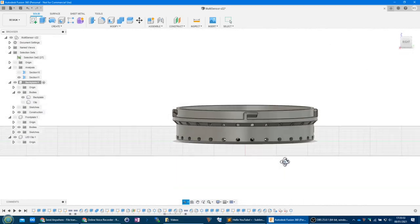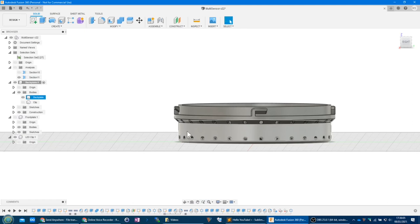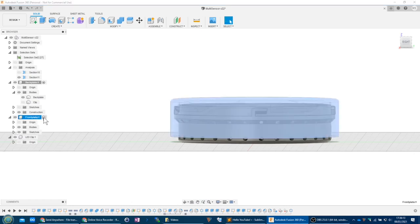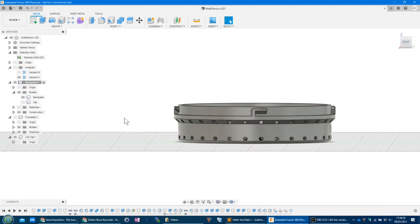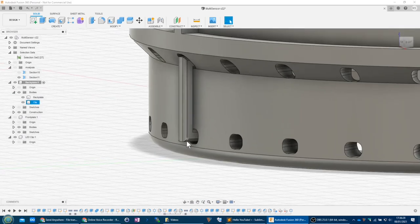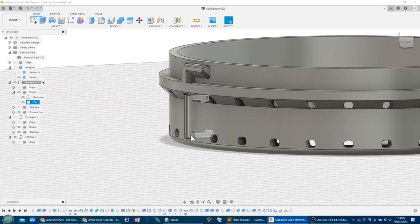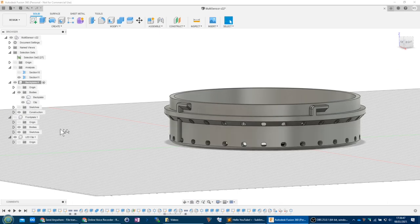So the side ventilation holes. Originally, I was only going to have one line of holes, and this entire nub section was much further down. But then a friend of mine suggested putting an LED strip on the outside, which, I mean, you can't see the LED strip directly, obviously, because the front plate goes over it, you see. But what it means is that you can put the LED strip round there, and I've got these little clips which look like this. See that? And we can just print as many of these as you like. That's the shape of the clip, and it goes through the hole, and you can pull them apart and pull them out again. That's just because the adhesive that is supplied on most LED strips seems to work for a year and then falls off, so that's not very good. So you can have as many of those around the circumference as you like, which I think is quite a nice detail.